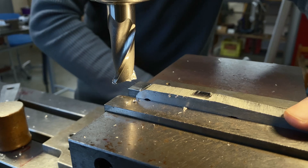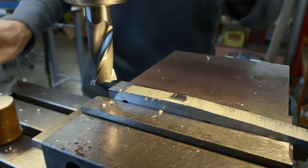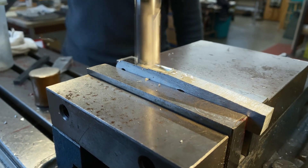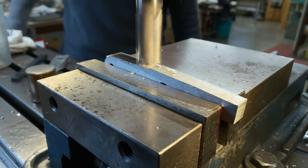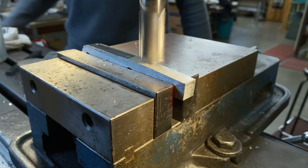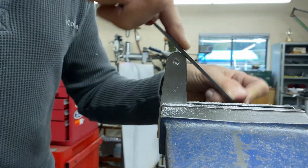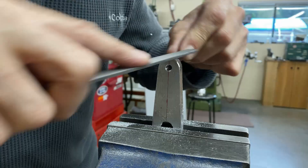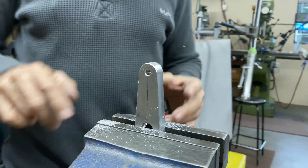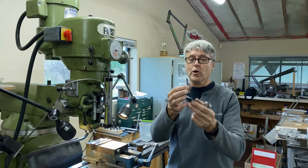It's going to go down just a touch. There you go — that was a touch. I can polish that a little bit later. A little five-sixteenths ball end mill. See how it's rounded? Goes in the collet.